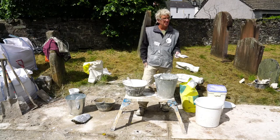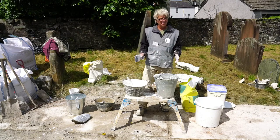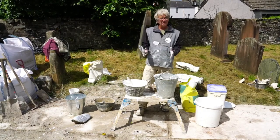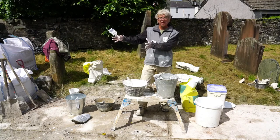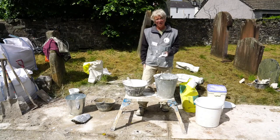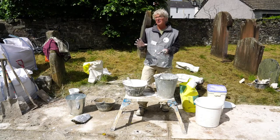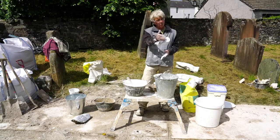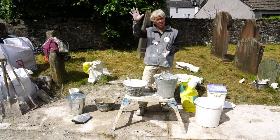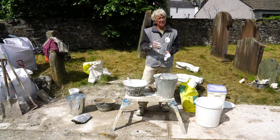So I hope that's a good explanation, and of course bear in mind the cost. You're getting, for a low cost, a hugely efficient material that will last a long time. I've got lime wash coats in Molton that we put on nearly 20 years ago that haven't needed doing again. And even with the water thin stuff, my house that you saw last night, I've just put another coat of hot lime wash on, and that was done with the water thin coat and had lasted 15 years.